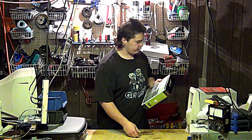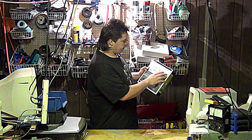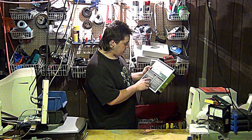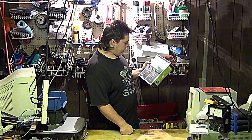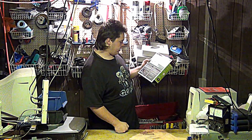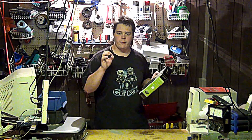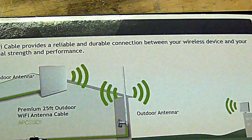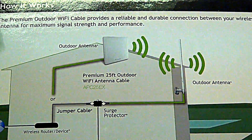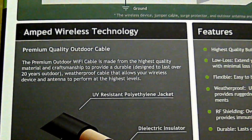Let's check out the back of the box. It shows how it works with a quick demonstration of what's actually inside the coax: UV-resistant polyethylene jacket, dielectric insulator, metallic RF shielding — and this is great shielding on this cable. This is LMR 400 equivalent specifications coax. I'll have a link in the description with the specification sheet on that particular cable. High-quality build material, low loss — extends your Wi-Fi antenna up to 25 feet with minimal loss in Wi-Fi signal strength. Easy to bend for simple installation.